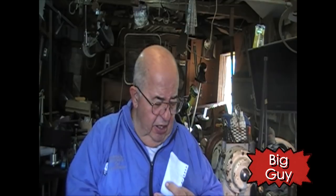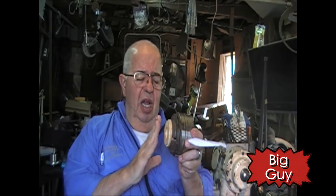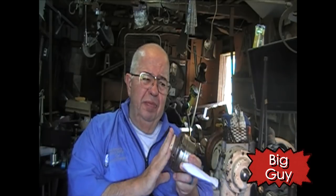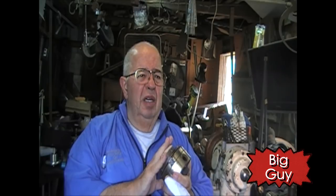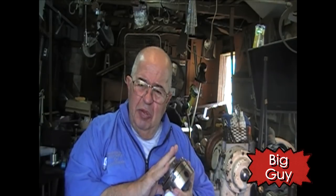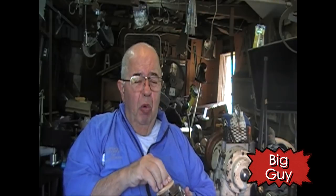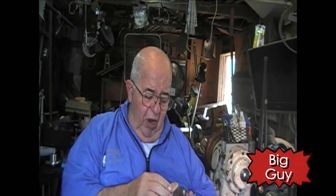So what I did the other day was I took a faceplate, my one-way chuck, and I faced it off, and then I treated it with super glue to seal it. I actually sealed it with super glue, one or two coats on it. When I glued the block of wood on it with the double stick tape, it's going to stick better to the wood, because the one that I had gave up off the wood, not off the epoxy. And it'll hold on a little bit better.